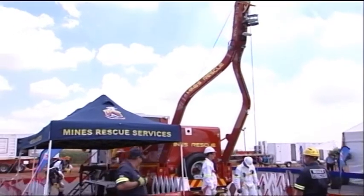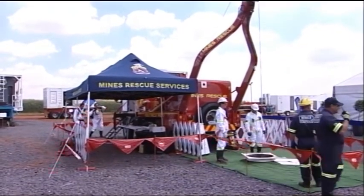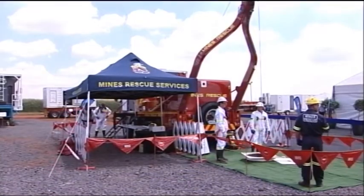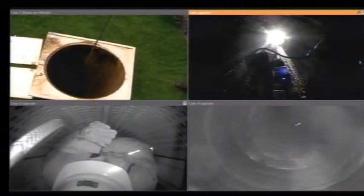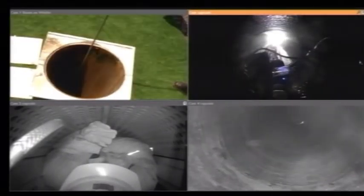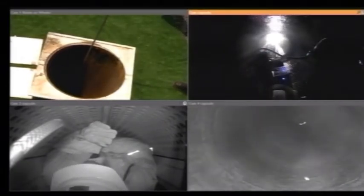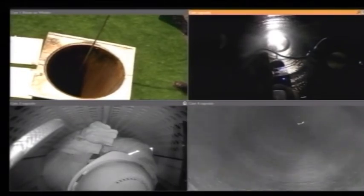We have got two means of communication. The one is through a shaft radio system built by Caduza, so we can speak directly to the person in the capsule. Safety devices include a load cell for the slack rope and tight rope. We've also got a CH4 sensor as well as a CO sensor. In the event of any flammable gas, the driver will get a warning immediately and we will retract the capsule back to surface.